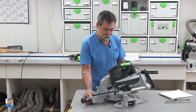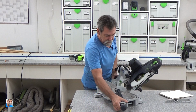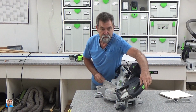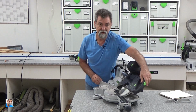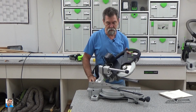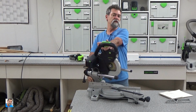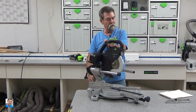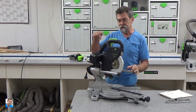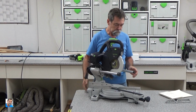And even around at 61 degrees, I have full travel. All right, raise it back up again by releasing the clamp up to the top and then backwards, and it will stop at 90 degrees at that positive stop, and then I clamp it. It's not going to stay there on its own. I have to clamp it.